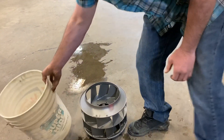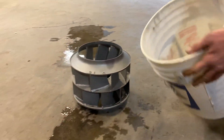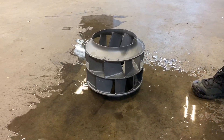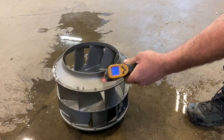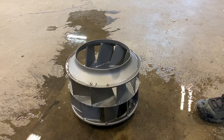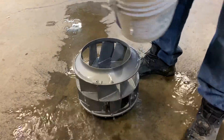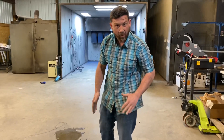So right now I'm going to pour cold water directly on it — room temperature water, 68 degrees. Really fast, it cooled it down to 200 degrees. I'm going to put a little more, try to get the part cooled off the best we can. And then I'm going to clean it with some alcohol and a rag and show you that some of that soot that's on there will come off. It's still permanent — it still does what it's supposed to do. There is slight discoloration when you take it up to higher temperatures above 1,000 and you add cold water right to it — it's a thermal shock.